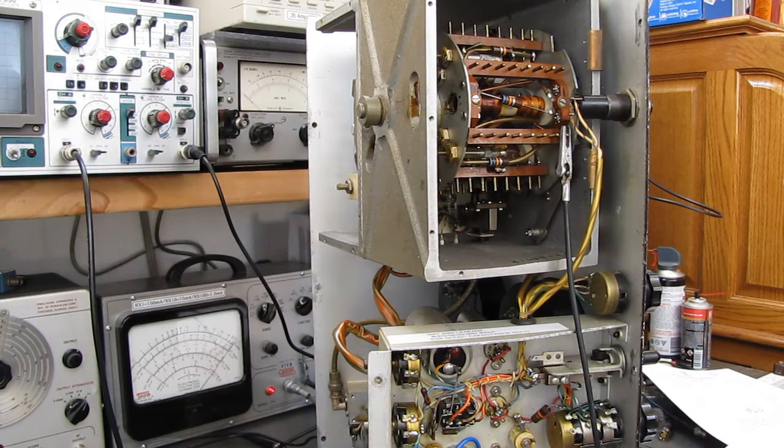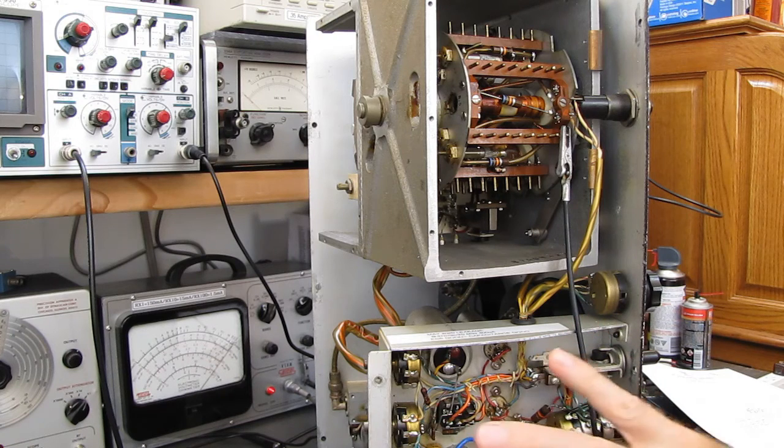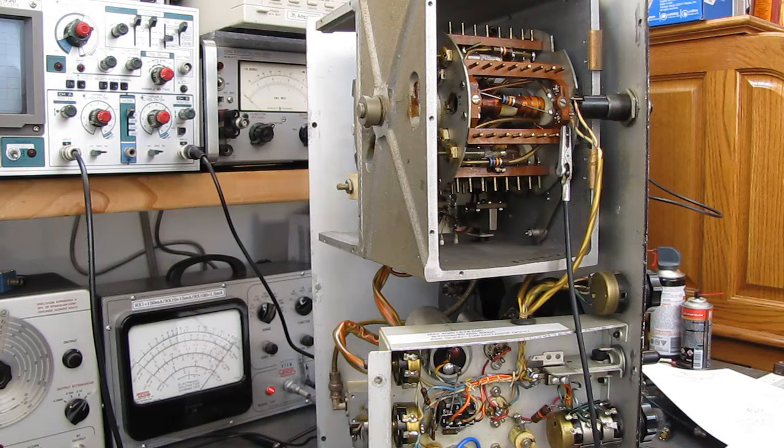It's a 450 volt cap and it's running at 300 volts. I set it up with 375 volts. I went 75 volts above its normal operating voltage in this unit, still within its safe range, and let it sit for about 15-20 minutes. And it only had 400 microamps of leakage and was falling. It's as good as a brand new cap practically.